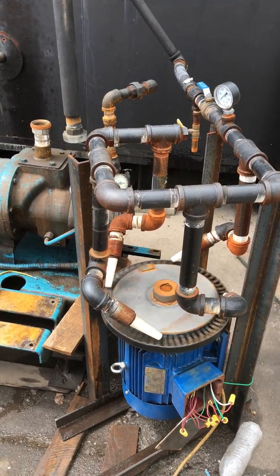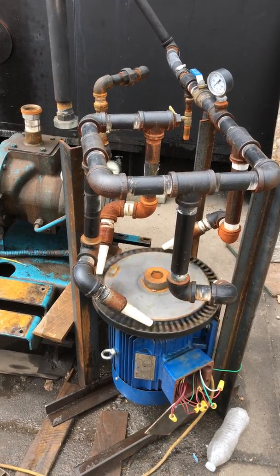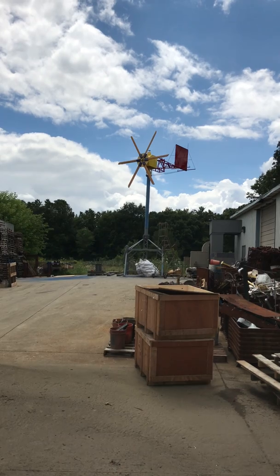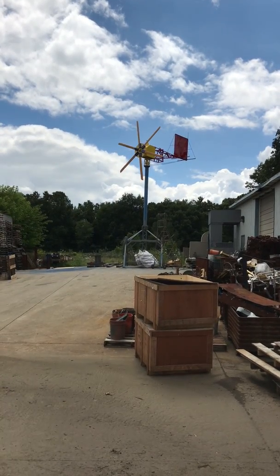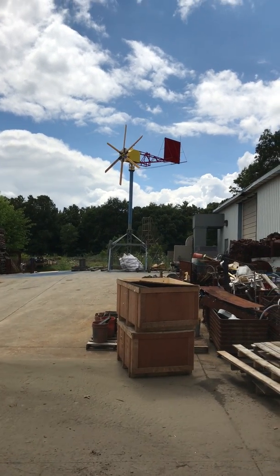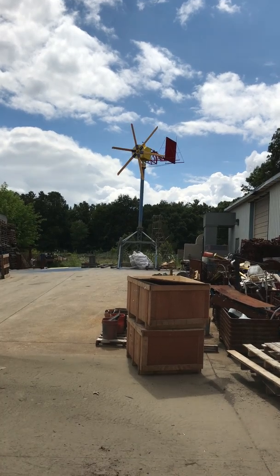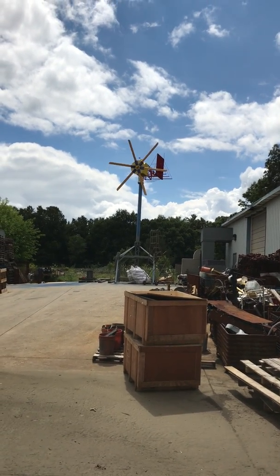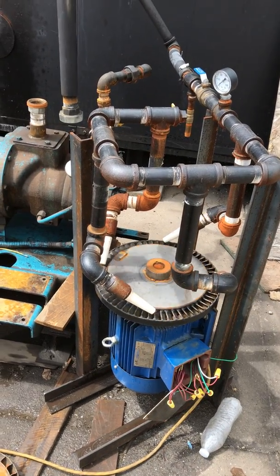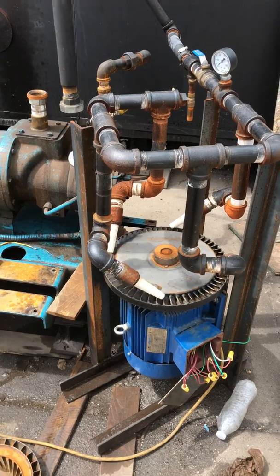These are great for wind turbines because you can get much higher voltages at fairly low RPMs. We do have a wind turbine we'll be doing that with as well — that one is going to be wired for 230 volts and then rectified. If that blade is turning, we begin to generate; it starts out at 12 volts and goes up from there. Max speed on that gives us 480 volts, with the motor wired at 56 RPM on the face of that turbine. We prefer the high voltage — you can do a lot more with it. Do have to be careful, so nobody who doesn't know what they're doing should play with these voltages. If you have questions, comments, or concerns, please leave those below and we'll help anybody with information — just don't kill yourself, and fair warning: you're dealing with electricity.